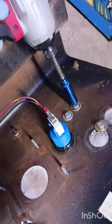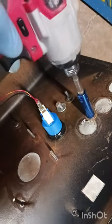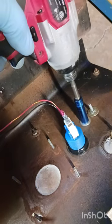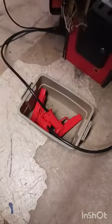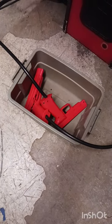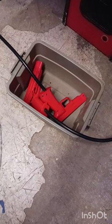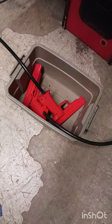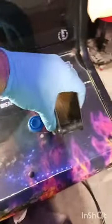I started the three nuts and snugged them down a little bit. We don't want to over-tighten them, but we don't want our holster flopping around either. You'll notice I laid my guns in a tote on the floor, because one of the easiest ways to damage them is bouncing them off a concrete or wooden floor — any kind of shock will break the sensors on the end of the boards inside. I'll show you those later in the video. Our holster is replaced and it's not going anywhere, so now we have something to hold our gun and keep it from falling on the ground.